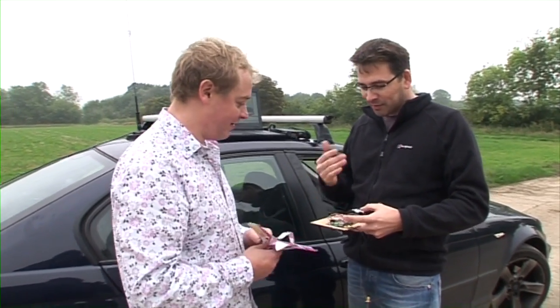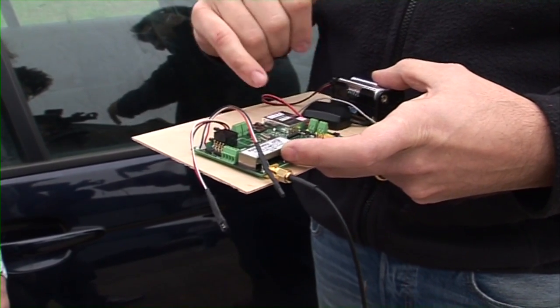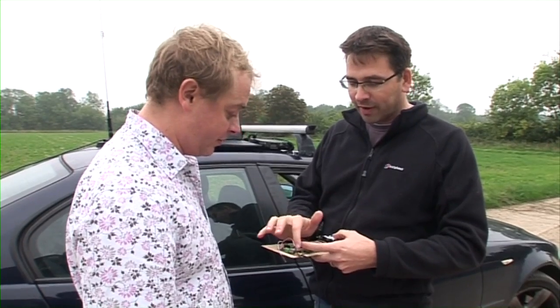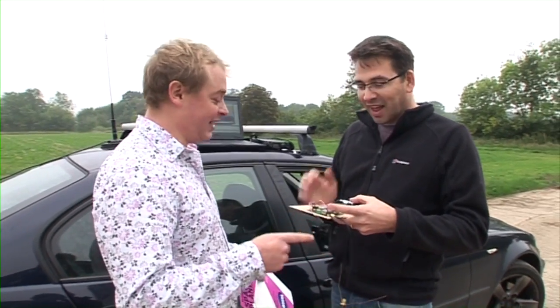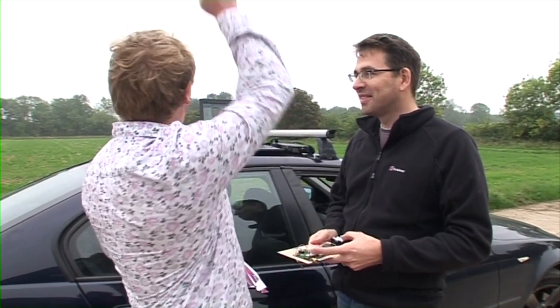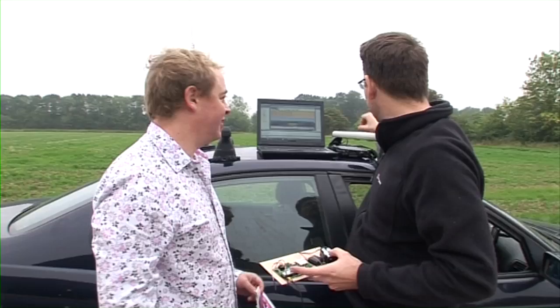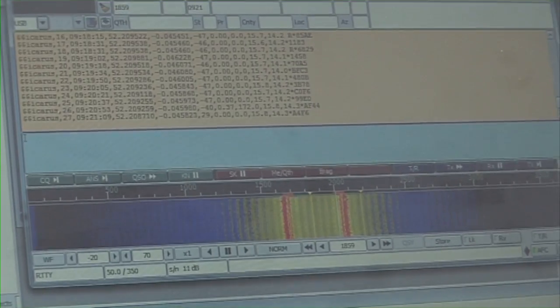So how's that going to work? I've made a simple system here. It's a GPS sat-nav like you get in a car. We've got a little microchip that converts that information into ones and zeros. That information goes out via the radio transmitter. This is up on the balloon — in space, at the edge of space — and it comes back down through the air, into the antenna here, into the radio and then into the computer here. This lets us know where it is: latitude, longitude and altitude.